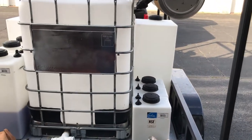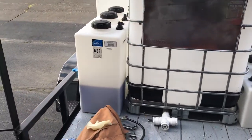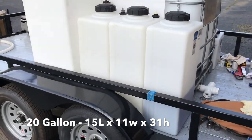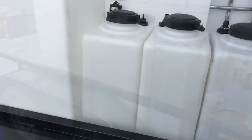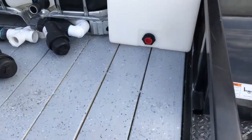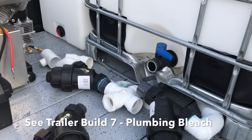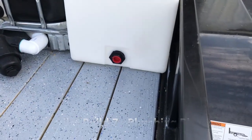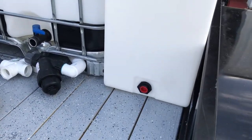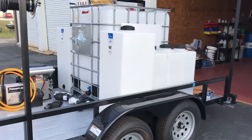All of our surfactants and soaps are on the residential or curb side of the trailer. On the other side we have a few more tanks — these are 20-gallon tanks and the other bleach tank. For weight purposes we separate these. You can see they have a one-inch female pipe thread valve on the bottom of each. We put a fitting on there and connect these two tanks with a hose at the bottom, so filling one fills both, and pulling from one pulls from both.